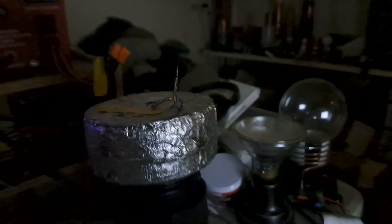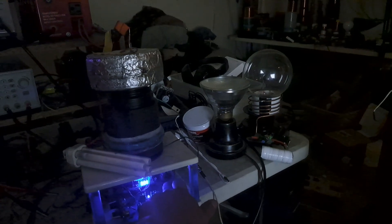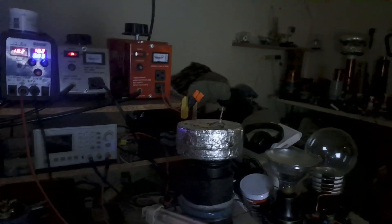Cutting on the buck right now. I've noticed when I first power this on I get that initial pulse right there. The only isolation I've got right now is between the ramp generator and the interrupter input. I'm just going to put it about right there and bring the voltage up a little bit. Kind of tuning around — this is the PLL so I have to tune a little bit.